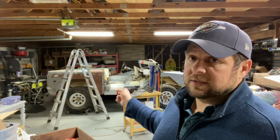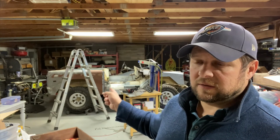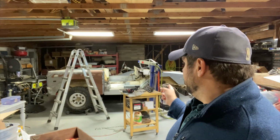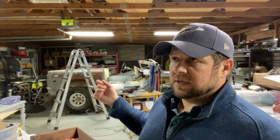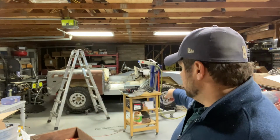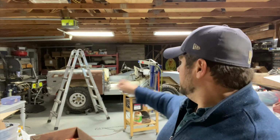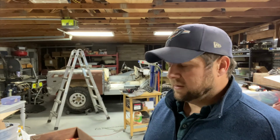And that being said, we need to drill holes for spot welds on the inner rocker across the top. And that little piece we build down here, we'll have to have a couple of spot welds on it. And then I think we'll drill the kick panel out for the spot welds. I'll do the same thing, get it where it needs to be, and then we'll trace it, and I'll come in and drill. So I know there's a bunch of spot welds on the lower part where the inner rocker and the kick panel meet, and up on the top where we replaced the piece that was rotten, there's a lot of spot welds in there. I forget how many, but it's a lot in that little section, because it's structural, so we'll have to drill that out pretty good.